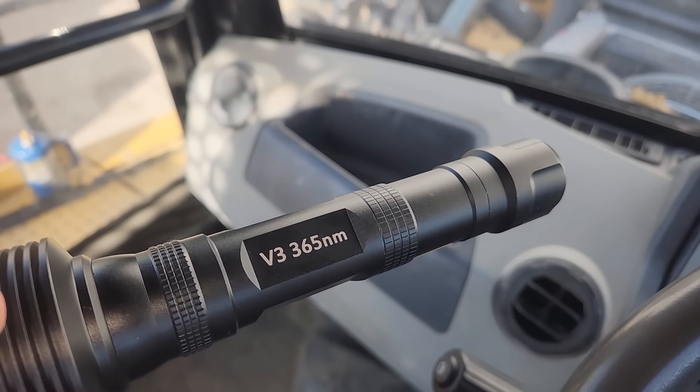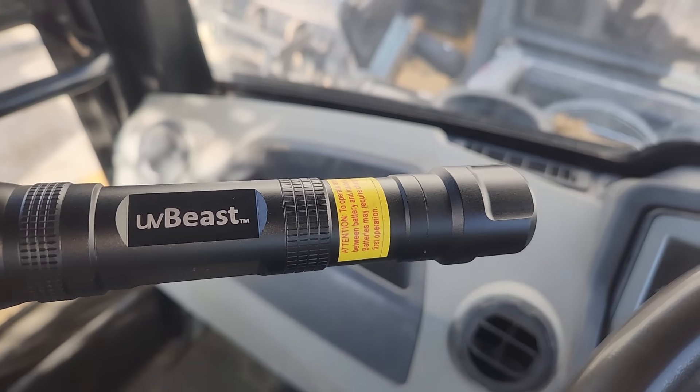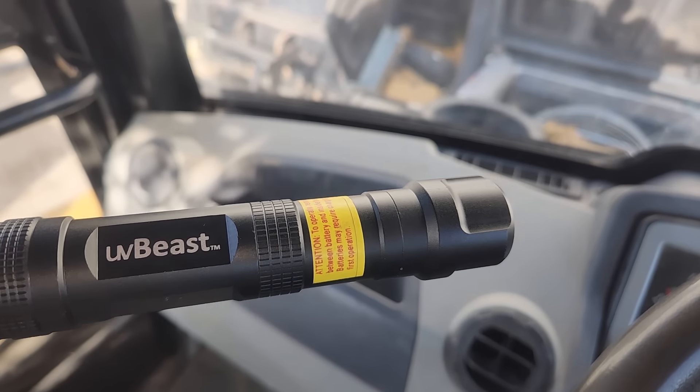So we need to clean it off thoroughly with spray clean. And what we're going to be using is the UV Beast ultraviolet light. Get this one, folks, if you're going to get a cordless ultraviolet light - they're not sponsoring the channel. I bought this and I love that black light. It's way better than any of the other little tiny pencil style ones - those are almost useless. We're just looking for a very bright yellow or green fluorescent color coming out from either the side here or the head gasket area. We ran it about 10 minutes and no leaks yet.